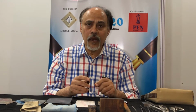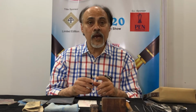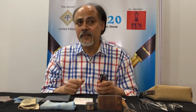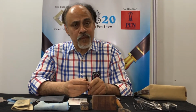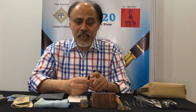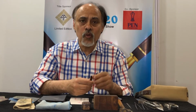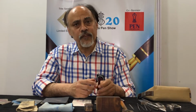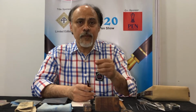One thing here I would like all of you to remember: the tipping material is very hard, whose hardness starts around 7.5 on the Mohs scale. So anything which we generally encounter is less hard than the tipping itself. The tipping is not creating the problem, but the abrasion on the tipping generally creates such scratchiness, and those are such minute abrasions that could be reduced or removed with a softer material, meaning softer than the tipping material. So for that, you are the best judge.